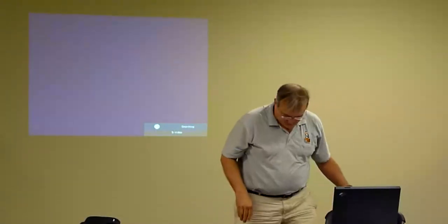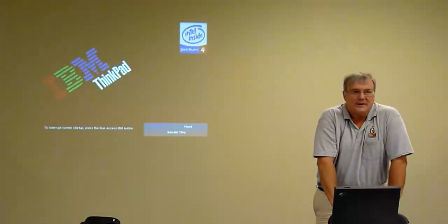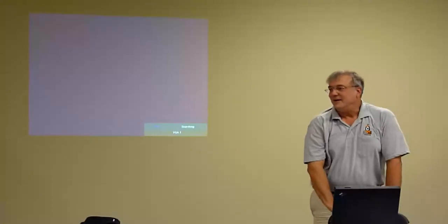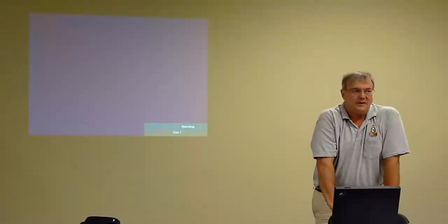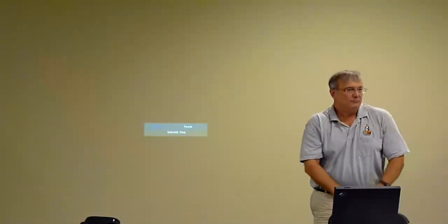So what I brought here is called a RepRap, which is a moniker for replicating rapid prototyping. It's a technology designed to be easily reproducible with few special purpose parts. Most of the parts that go into it are very generic. Threaded rod, smooth rod, pieces of plastic that you can make on one of the machines itself, or in this case, pieces of thin plywood that are cut with a laser cutter. The only special parts you have are the electronics and the stepper motors. Those are fairly widely available.